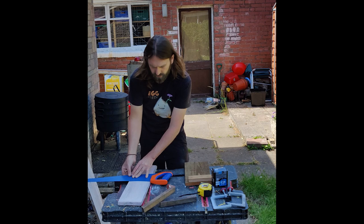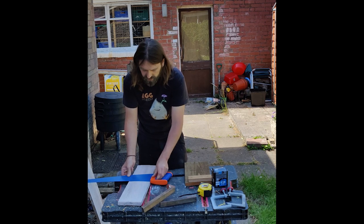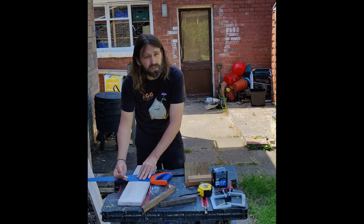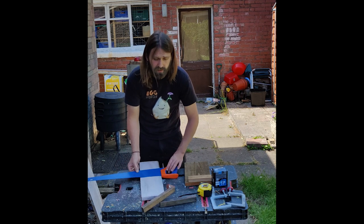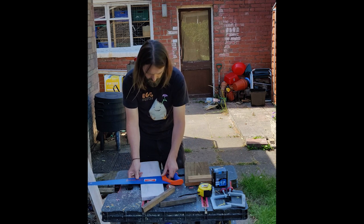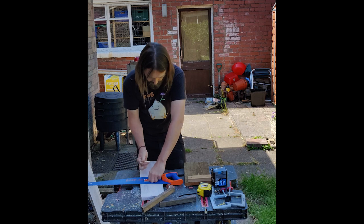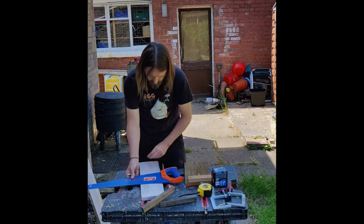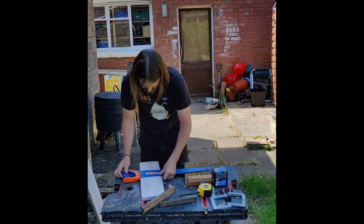So when I'm doing this, I'm making sure the plastic handle is right up against it, and it's not about just connecting up the dots with the edge of the saw. Now, I might want to just check that. I might then turn it over the other way and bring it back down to the line, bring it to my mark and go over. I'm happy with that. Just want to check it from the other side of the wood.